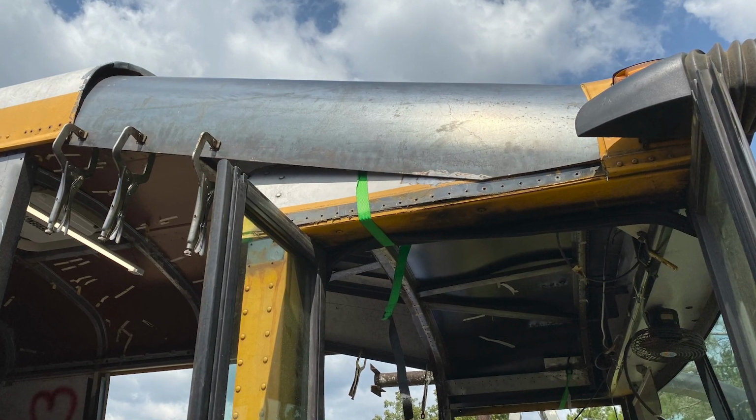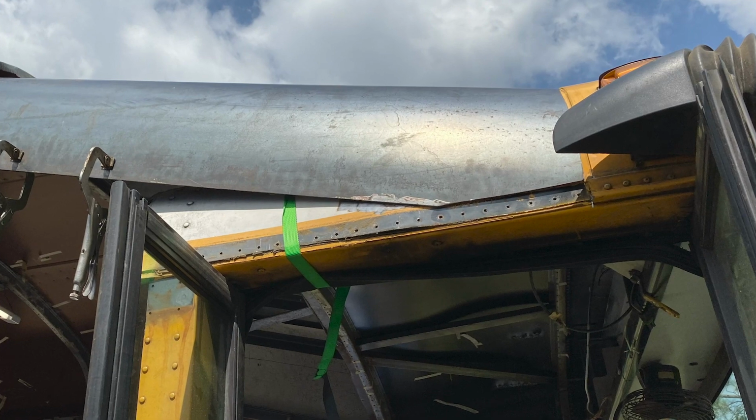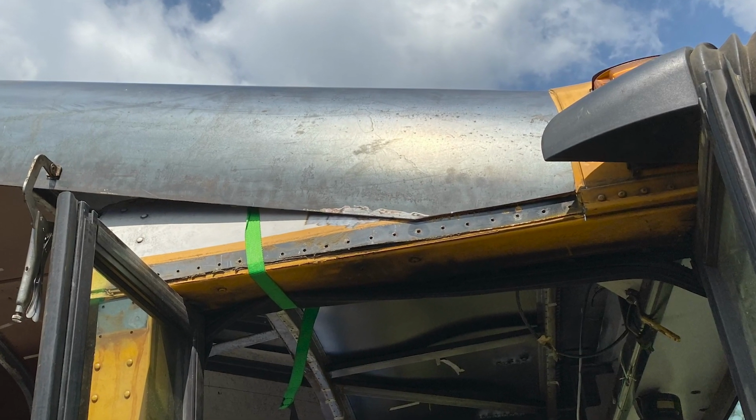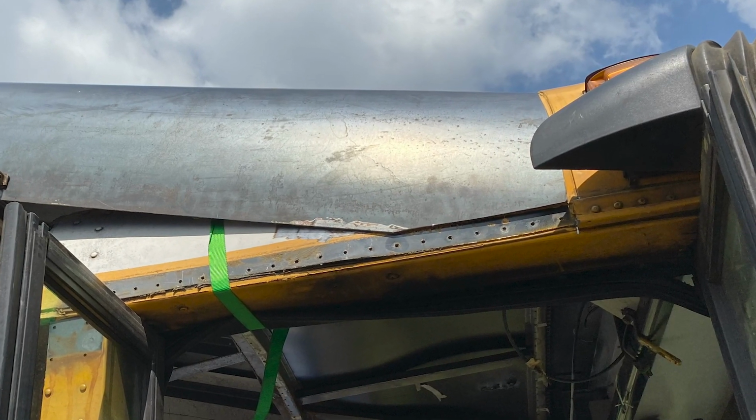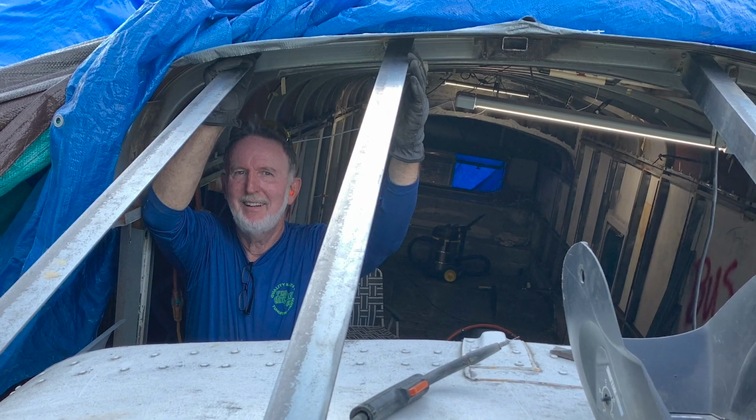And one of the funny things that we had to do, because our metal was so strong, we had to wrap a tow strap around the entire bus and secure it off on either side, and really just squeeze it to death in order to get the curve right. The furthest out support that we had welded in, that was our square line. So we were able to just start there, and we ran the rivets up all the way on that one, or on that outside edge. And then we had to get the tow strap to suck it down to the actual curve of the bus.